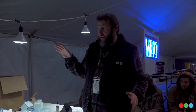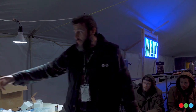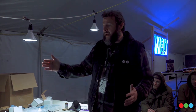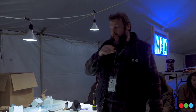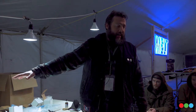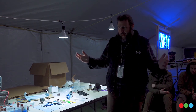So, if I cannot get this thing to function without that thing bouncing up to 0.2 volts, the lower one, something's wrong. Like my solution needs to be filtered. Something is off, a connection isn't happening. Okay, so with that being said, and that does happen, and it's an indicator for me that my solution is getting dirty, I don't wait for that to happen to tell me to filter my solution. I filter my solution after every three marbles. It's just the way I do it.